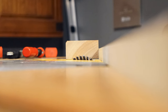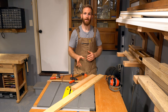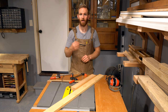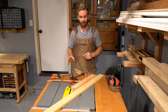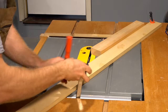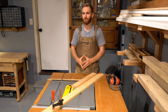Now we can arrange the fence and the piece of wood so that the wood passes through the blade and the cove, or semicircle, is perfectly in the middle of the lumber. As you take passes, make sure there's wood on the left side and the right side still, so the wood has support on either side — you don't want to cut one of the edges out, as that'll ruin your cove. The cove needs to be cut out in the center of the lumber. After this is all set up, clamp the temporary fence securely onto your table saw.